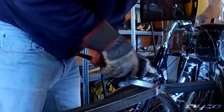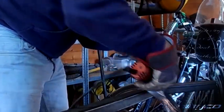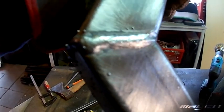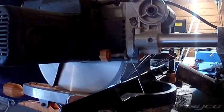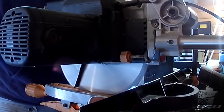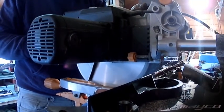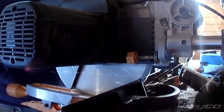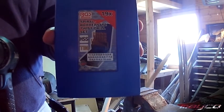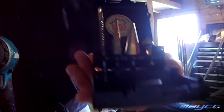As I mentioned earlier, if you want to weld you can go for flux wire, but if you're interested in welding and want to learn more — for example, in that course we also learned about positioning: what positions are good to weld, what positions you should avoid. And as we do special projects, you get what is called a WPS — a Welding Procedure Specification. What that basically says is, for example, this procedure needs to be done with MIG or TIG, at a voltage range between 24 and 27 volts, an amperage range of 160 to 200 amps, with a wire speed between 8 and 10 — and with my machine I could do none of these things.